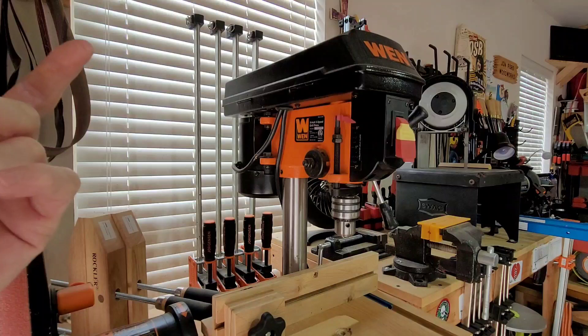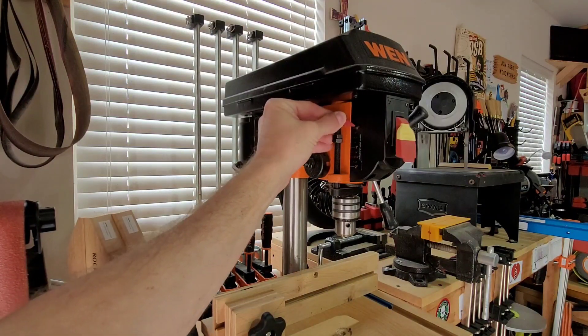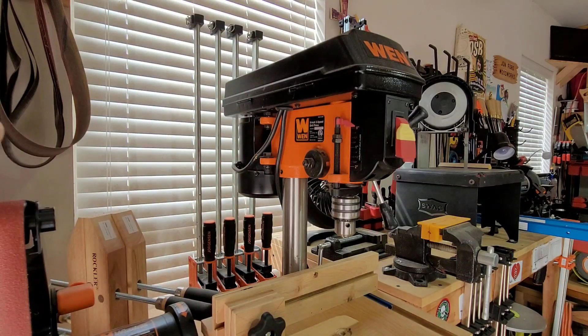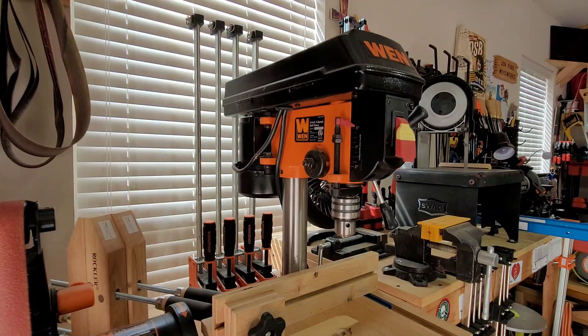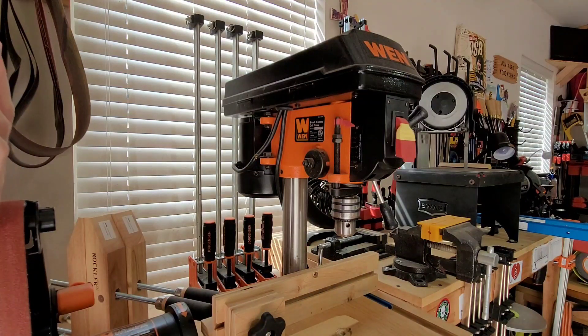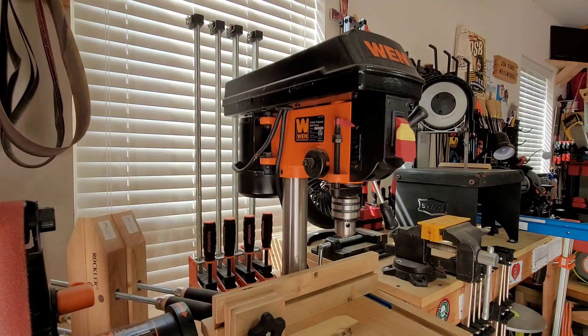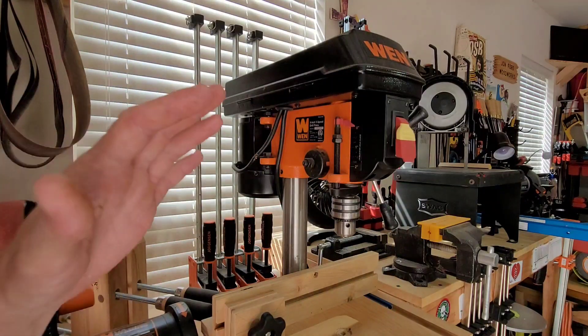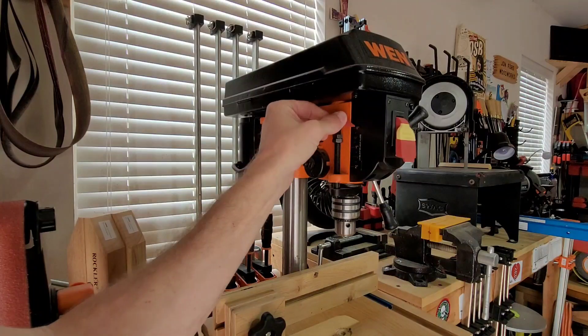From this side you can see the only other real feature that this drill press has, which is a depth stop. I've used it before, but it's not easy to use — it's the one negative about this drill press. But again, at sub one hundred dollars, what are you going to do? It does have one, though I don't know how much I would trust the measurements. Moving one screw and moving the other screw and then locking those screws without that position moving is tricky and takes some time. But if you do want to set it to a certain depth, you can do that — it's just finicky. I would use something else to measure; I don't know how much I would trust that scale.